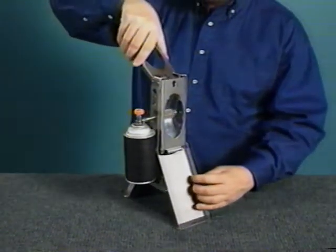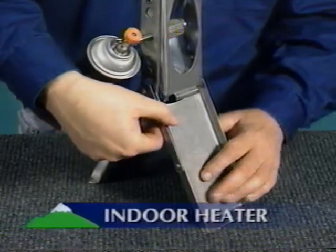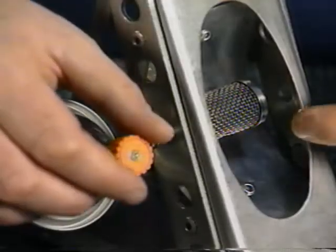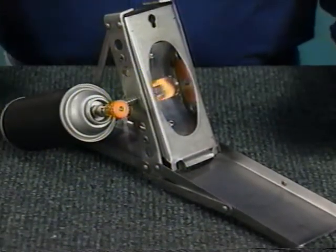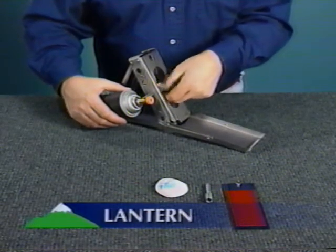Make sure your heater is placed on level ground to prevent it from tipping over. For uneven ground or indoor conditions, unlock the leg lock clips. Open the cover plates so that they lie flat against the ground. Pull the back oval arm down so that it fits inside the rear cover plate. Make sure that the fuel can rests behind the unit while it is in use.